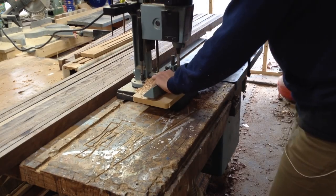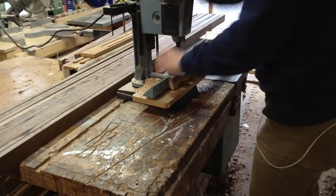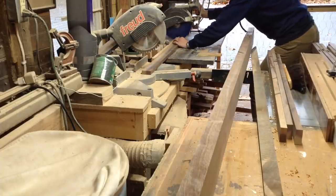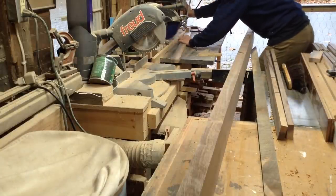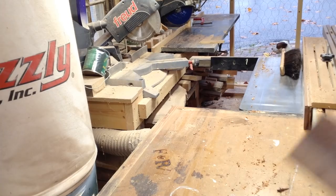This is a 3/8-inch mortising bit. I marked all my mortises before starting — with 12 sides there are 24 mortises, and it can get confusing which side goes where. So I marked them all and then mortised out all those positions. This is a 3/8-inch bit and I'm not going to have any shoulders at the top, so it's a 2-inch mortise. Then I can go through and cut the cross pieces that I'll put tenons on to join the sides.